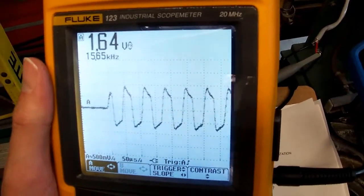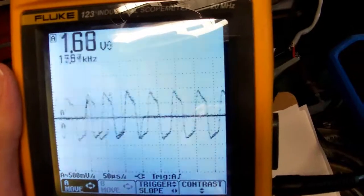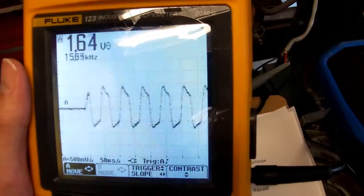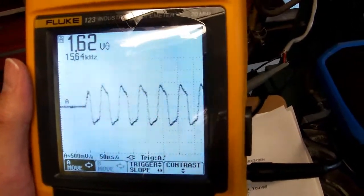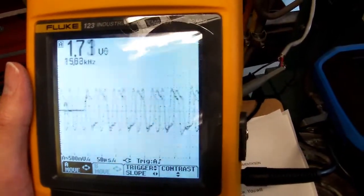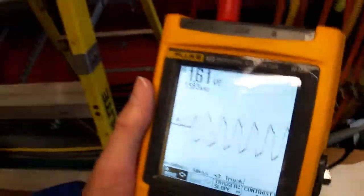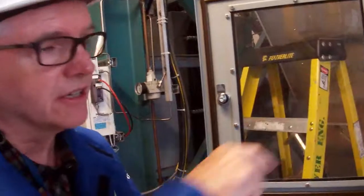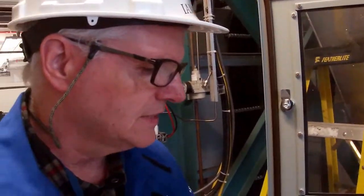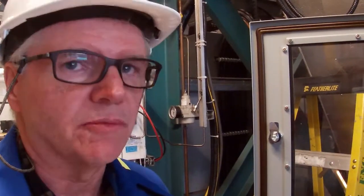Now we've got 1.6, 1.7 volts peak. Can you guys remember why we would be reading 1.6, 1.7 volts when we remove a terminator? Remember that we have two terminators on a field bus network. We have one back in the DCS, and the other one is here on our segment protector. Remember that they're 100 ohm, 1 microfarad terminators.